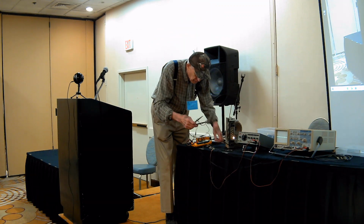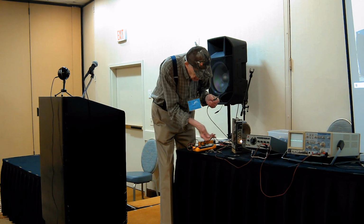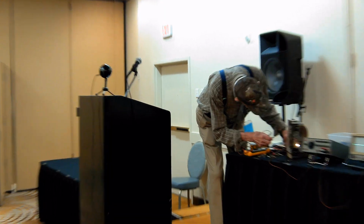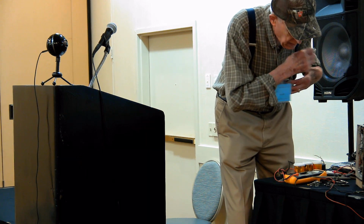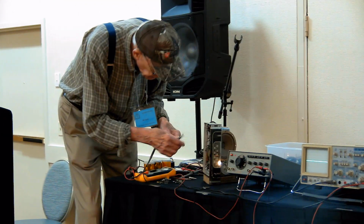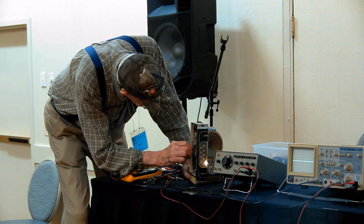One of the things we can do is, using channel A, for example, we'll take a look and see if the local oscillator is moving. Let's see if it's really working. And this should not spark when I touch the B minus with it. If I have any luck at all, where is it? Oh, here it is. This is B minus. So I do get some buzzing.